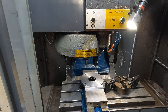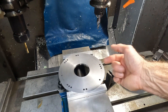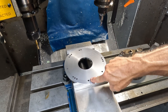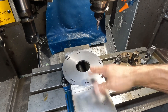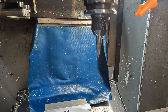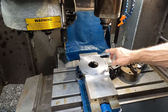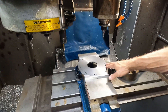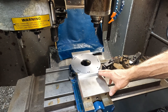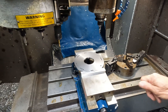We have a special end mill — these holes have to be tapered. The pin that engages these holes on the cam grinder is a tapered pin, so it locks in and doesn't have any play. We had an end mill ground on that correct taper, so we drill a pilot hole and then come back and ring the taper with a carbide end mill. It works like a champ and fits nice on the pin on the machine.